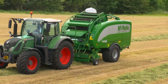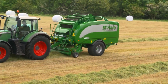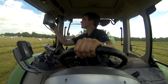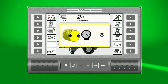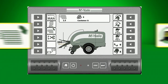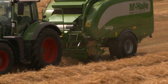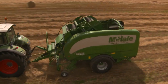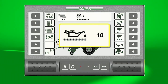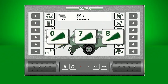The iTouch control console, when combined with the load sensing valve on the Fusion Vario, is capable of making baler and wrapping operation fully automatic. From the comfort of the tractor cab, the operator can adjust bale size, bale core density, overall bale density, net wrap layers and the number of layers of bale wrap. The machine is also fitted with crop flow indicators, which indicate to the operator which side of the bale to fill when working in uneven swaths. Its lube check alarm reminds the operator to check grease and oil levels, while forage chop length can be adjusted using the selectable knife option.